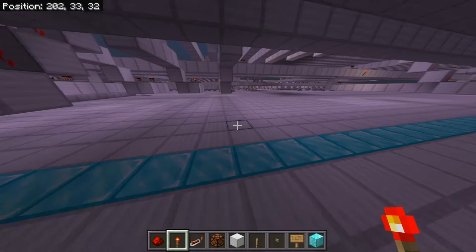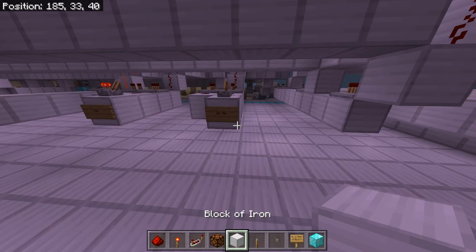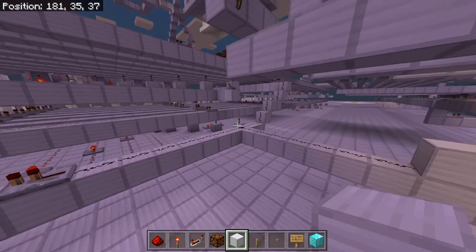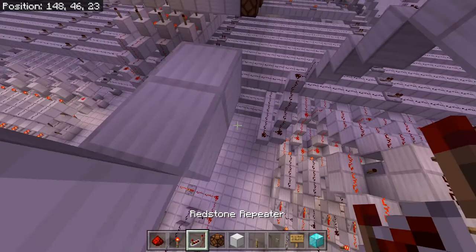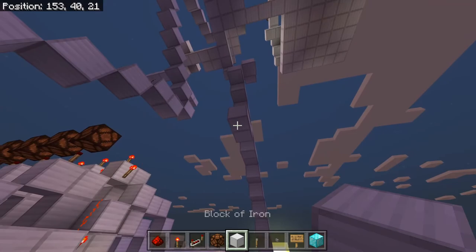Okay, so the clear is correctly hooked up. Again, disable the write operation. Now to connect up this clock. Bring this out the other way. Again, I'm going to try and go underneath the arithmetic unit data buses.